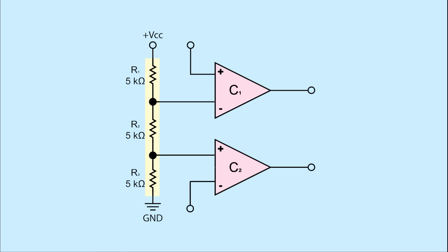Now let's take a look at comparator 2. On this comparator, the positive input is connected to the voltage divider, getting 1/3 of VCC. So with 9 volts VCC, that makes the input 3 volts. The negative input goes to pin 2, the trigger. If the voltage at that pin is below 3 volts, the output goes high. If pin 2 goes above 3 volts, becoming the larger input, the output would go low. And again, as soon as pin 2 drops below 3 volts, the output will revert to high.